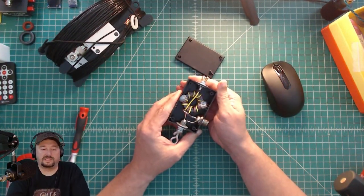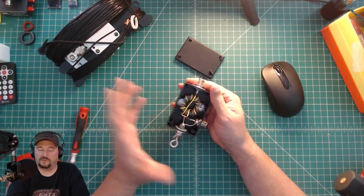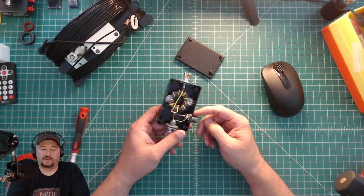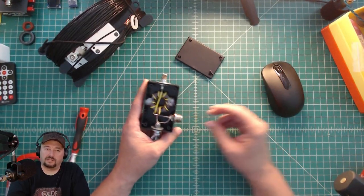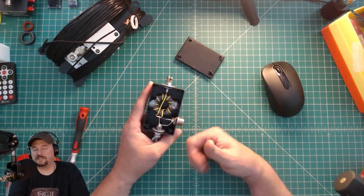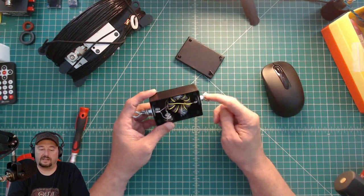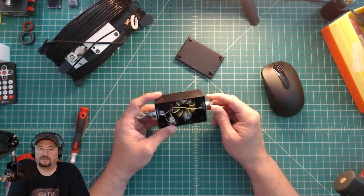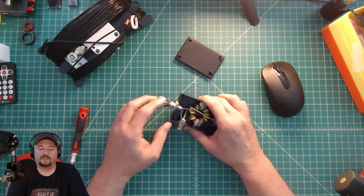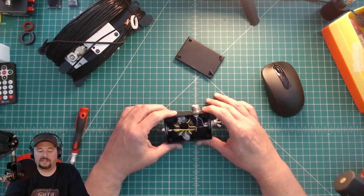When you open this up, you can see it's a 9-to-1 wrapped toroid — I'm assuming a 140-43 or 31, probably a 43. Your coax comes in from your radio, I put an RF choke here because I get a lot of common mode current interference back down the coax line to my radio. Then I put my radiating element here and hook a counterpoise — typically a 17-foot counterpoise works well for me on EFED antennas.